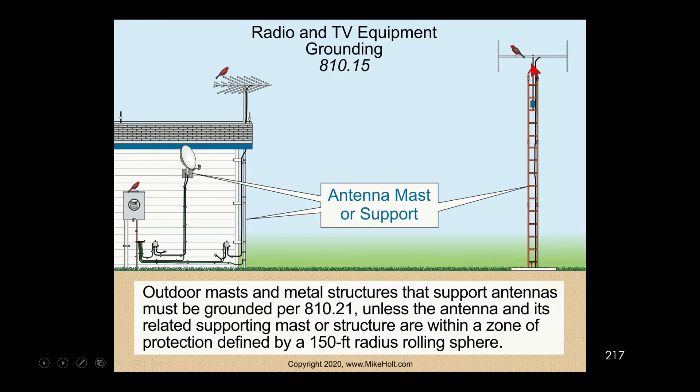And then what they want to do is they don't want to ground the cable that comes in, and they don't want to ground the mast to the building. They want to keep it separate. That means the cable coming in is connected to this end of the earth, goes inside, and goes into a very expensive piece of equipment — and they wipe out their equipment.